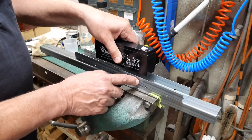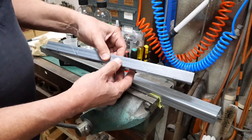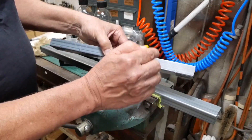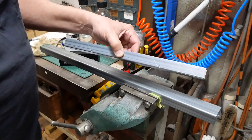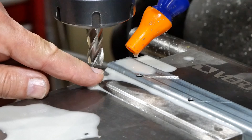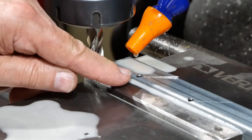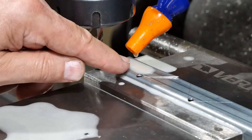The idea now is to bend the sides up and then put a mounting tab on each end. I've marked it out — I don't know how well that'll show up — and drilled holes here. I'm going to cut these V-notches out so I can bend the ends up, then cut this off so I can bend the end over and get a tab to use to mount this. I want to remove a couple of pieces off the end here using an end mill to cut the corner out, with holes drilled at critical points so the cuts have got somewhere to run out into.